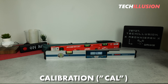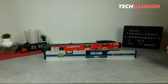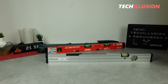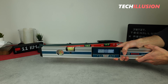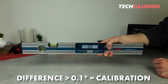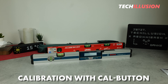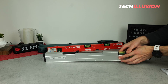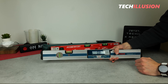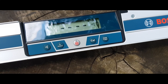To check calibration, place the spirit level on a surface with an inclination of less than 5 degrees and read the value — it shows 0.3. Then rotate the device 180 degrees along the vertical axis, let it settle, press hold, and read again — it shows 0.8. A difference of 0.5 degrees means calibration is needed; once the difference exceeds 0.1 degrees, calibration should be done without question. To calibrate, repeat the same procedure: place it on the surface, press CAL — CAL1 appears and the value blinks. Rotate 180 degrees, let it settle, press CAL again — CAL2 appears, indicating recalibration is complete. This can be done both horizontally and vertically.